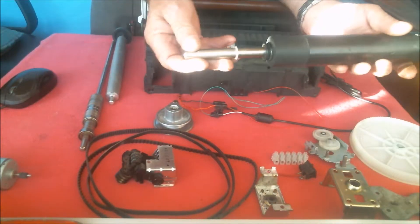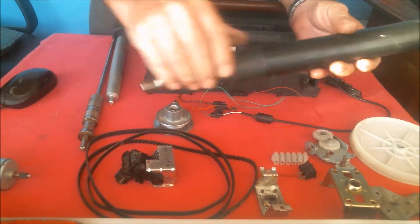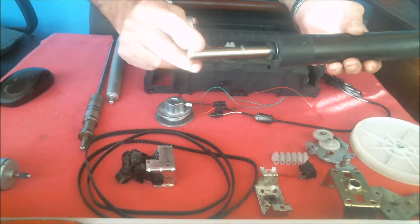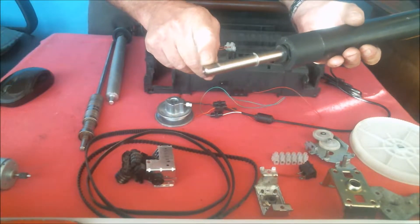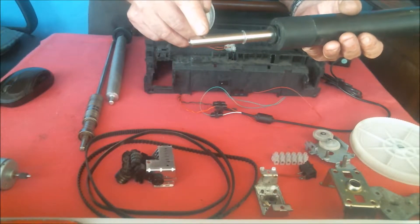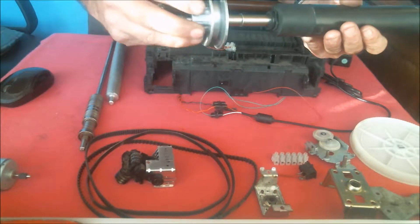The other materials I've used to make my tumbler include rollers taken off printers. Ideally they should have a big diameter and have a rubber sleeve over them to help in turning the bottle or cylinder. A round shaft with a round wheel can simply slip under tension. A shaft with a cutout is a better option for driving a pulley or sheave if the sheave fits snugly and has a matching cutout, or like in this case, has a bolt that holds it firmly in the cutout.